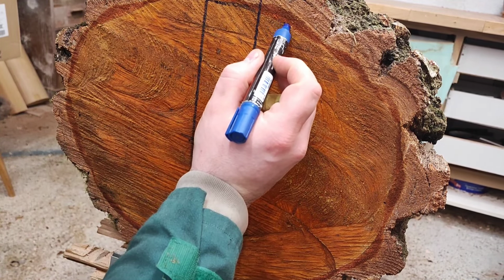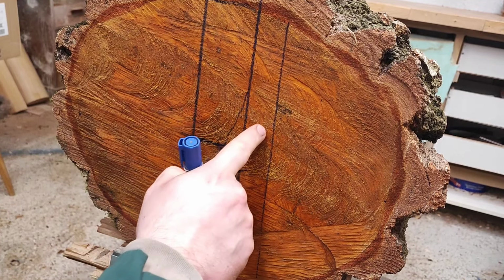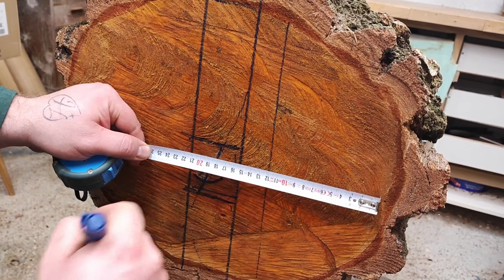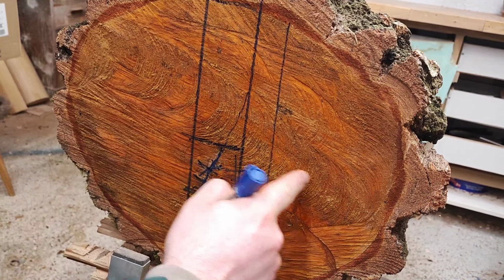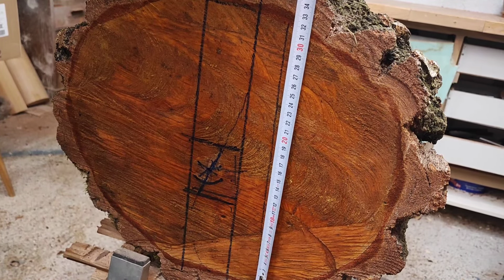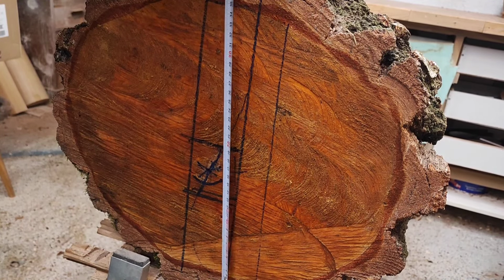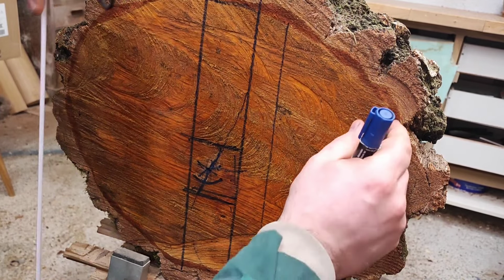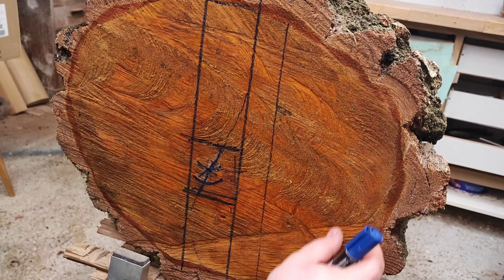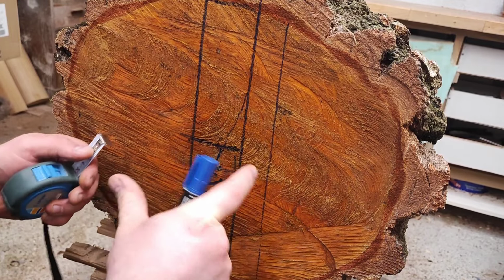So we can take a thinner slice, let's say like this, potentially, and get a platter blank, and that will leave here roughly 120 mil tall or deep dish, and diameter roughly will be 300 mil. That's 12 inches, so that's a pretty good size bowl. Or we can slice here, make a thinner slice here, and make a dish here, like a plate or a platter. So that's a little bit for you to decide.